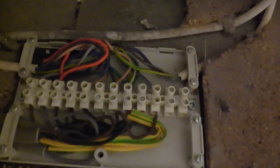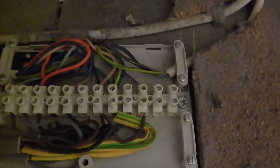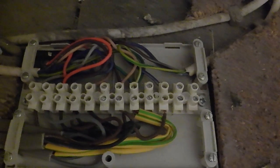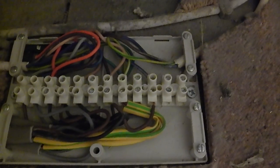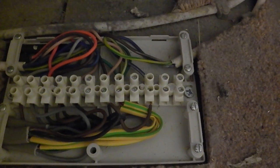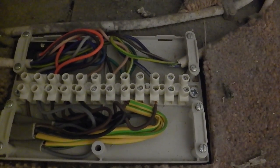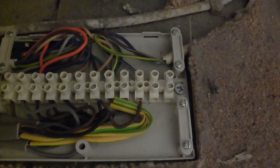As you can see, there are three main live wires connected to the back of the device — the wires that fire up the boiler for heating and the wires that fire up the water heating. The Nest only handles the heating part, so you need to make sure the water heating stays on for the entire duration. The next step is to look and locate where your thermostat is and start to install that part.